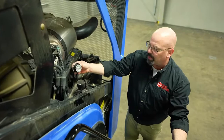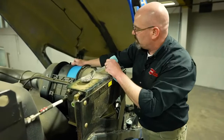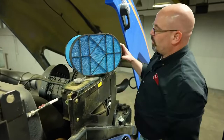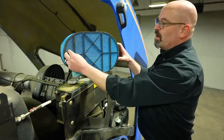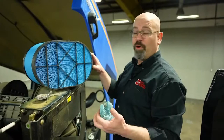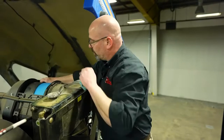The air filters on these are the new power core style. The air flows through very small honeycombs — small channels — and all the dirt is captured in here. These filters are not very easy to blow out, and we actually don't recommend blowing them out very much. With the aspiration system on this sprayer, these filters should last a year no problem. Just change the primary filter every year, and the primary and secondary filter after two years. It's really important to make sure that you put the top on properly, because the top actually positions the filter to make sure it is sealed properly.